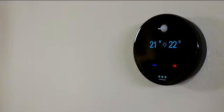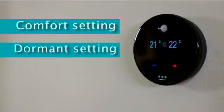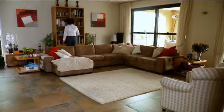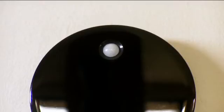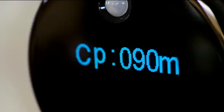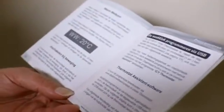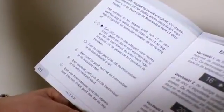There are various settings: the comfort setting, the dormant setting, and the anti-frost setting. The comfort setting is the temperature you want when you are at home, and is maintained for as long as the thermostat registers people present, plus a comfort period that you can set — one hour for example. After that, the thermostat switches to the dormant setting. If you are away for a long period, the thermostat automatically switches to the anti-frost setting — the minimum temperature which ensures that your apartment would not become damp. In the thermostat's manual, you can find more details about manually programming the thermostat and about the abbreviations and symbols that are used.